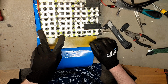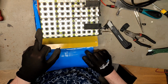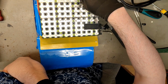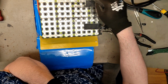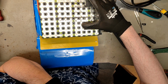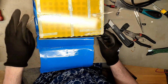Yeah, if we were to build it, we would do it two cells less. 1, 2, 3. Yeah, we would probably do 11p going up here, a lot simpler, and then we have a lot of space for bus bars on both sides, and it's 9, so we would have a lot of margin, higher capacity. We don't know how many amps this one is pulling.